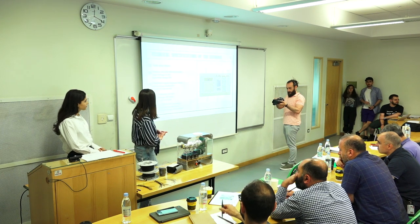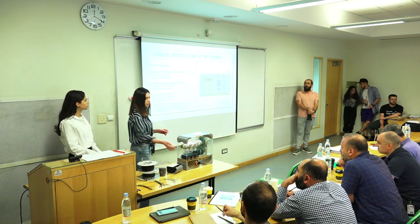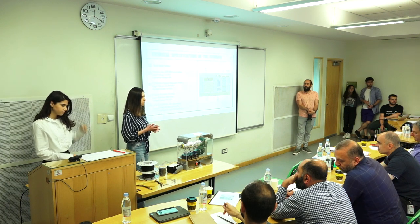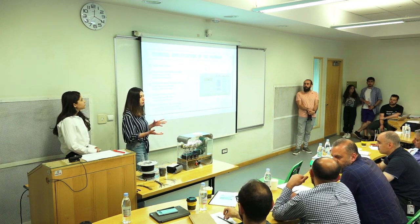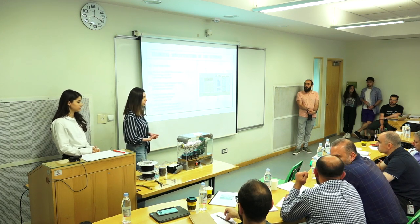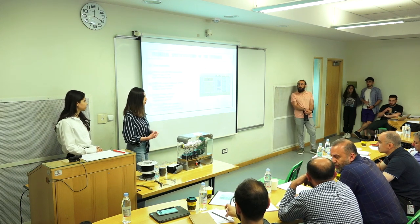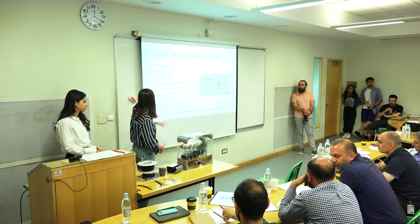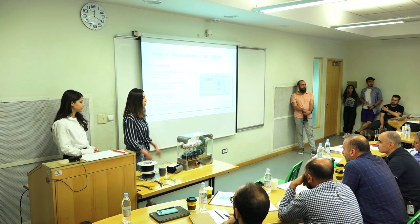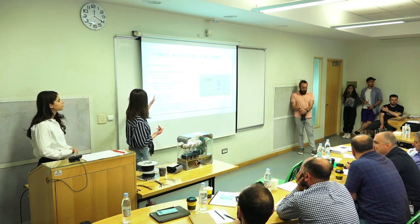So first we have three solid state relays here, and these are controlled by the PID controllers, and they have two modes of normally open and normally closed, which are used to turn on and off the heaters. Then we use an Arduino Uno microcontroller in order to write a program and drive the stepper motor and the driver. And then we use this digital stepper driver, which allows us to control the high current NEMA stepper motor using just a very low current microcontroller.